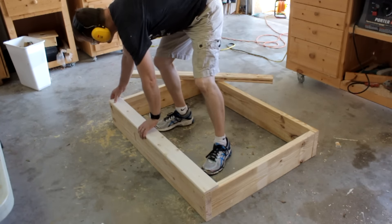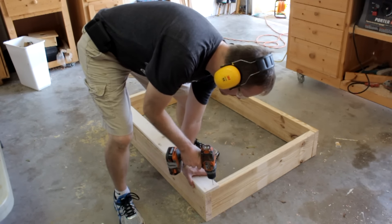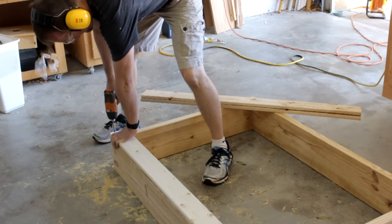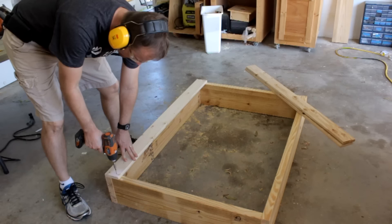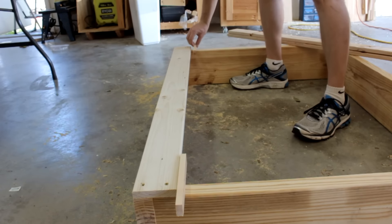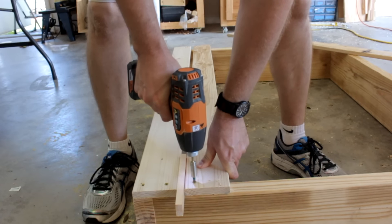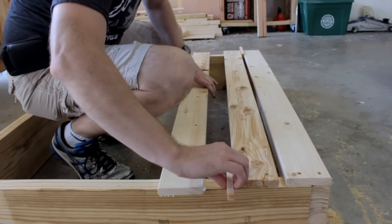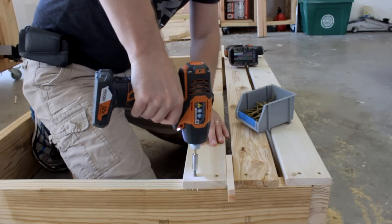Just lay the boards on top of the base frame and flush the ends. When you're working near the ends of boards like this, drilling pilot holes is almost a necessity so that you don't split the ends. Then drive some screws. Measuring when you don't have to — well that's a waste of venture. Spacers between the boards will help me keep an even spacing without even trying. I'll do that for 3 of these boards because the top cover is going to be in 3 segments.